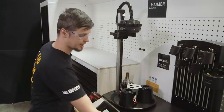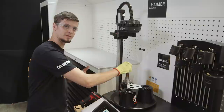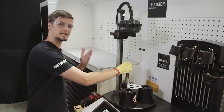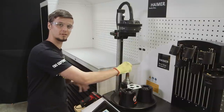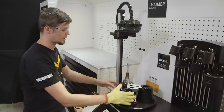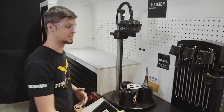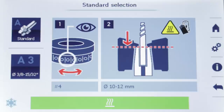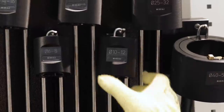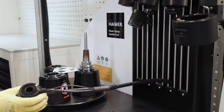Once it's hot, I'm going to move the element out of the way, grab my tool, and place it in. I will lift the tool up just a little bit so that later on when I balance it, I know I won't have any interference with the cooling of the outside of my holder. Now the holder has cooled a little bit, so I can turn my station to its cooling spot and place my cooling ring over my holder — this setup tells me exactly what cooling ring to use, and I'm going to use the 10 to 12 millimeter cooling ring.